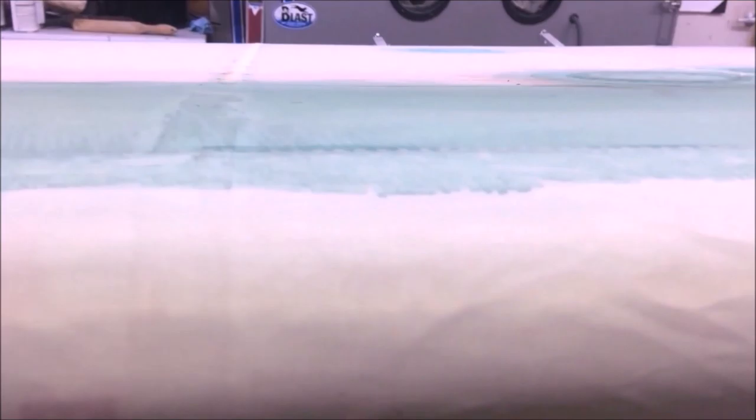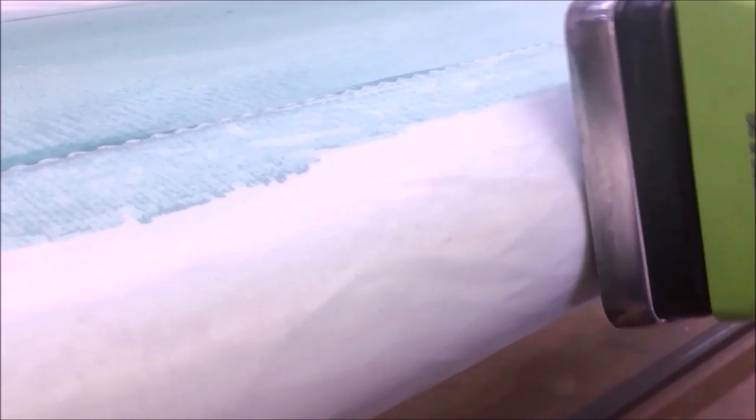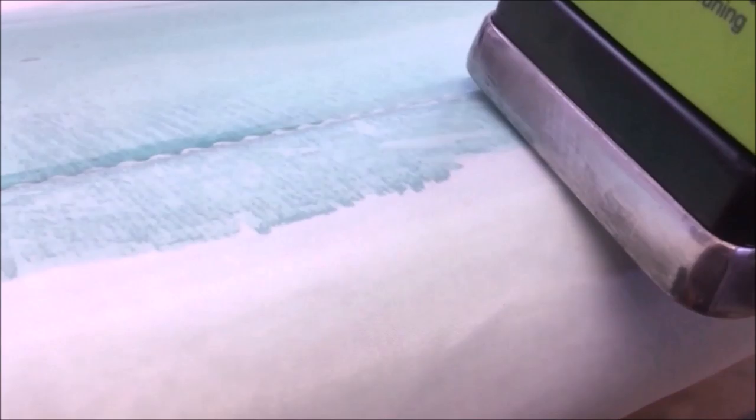We're going to take our iron here. We're at 123, which is a little better than 250 degrees, I'd say about 260. And I'm going to start slowly shrinking this fabric. And if you watch, you'll see, it's kind of hard holding the iron and doing the shrink here. I don't want to go right over to the edge. But what we're after is that nice, hard, perfect leading edge. You can see right exactly where I stopped. This is unironed. This is just ironed at 250 or 260. We're going to come back and sneak up on it. We're going to want to take it all the way up to 300. But we'll take it up nice and slow.